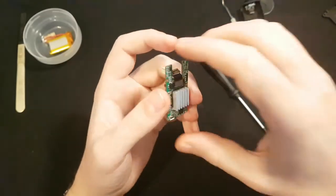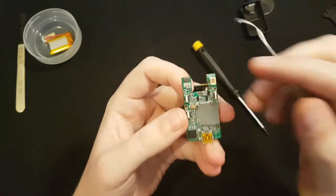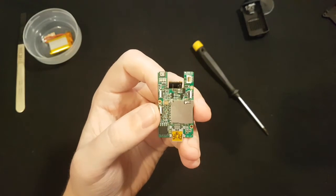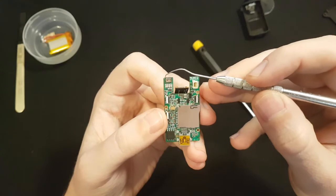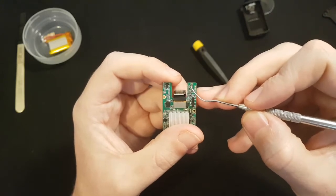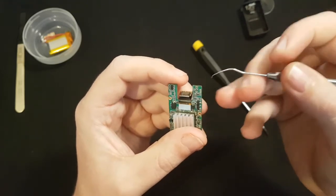Decasing the board from the camera — if we look on the underside, this top left corner here, because remember you're going to be looking at it from this direction, this is your little microphone chip. You're going to want to be prying this off towards yourself. If you remember that underneath this top left corner there's actually quite a big clear area of pad — there are a couple of little capacitors just there — you want to watch out and try not to pull on those.